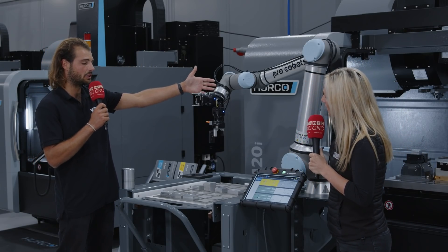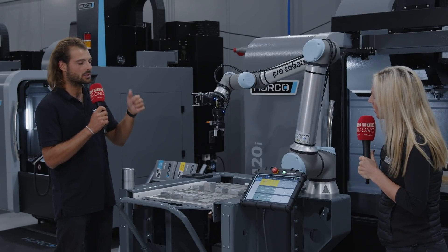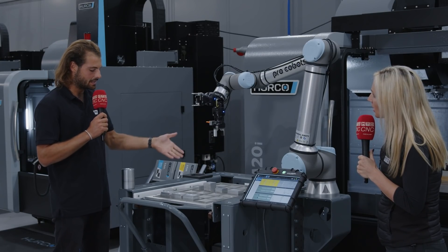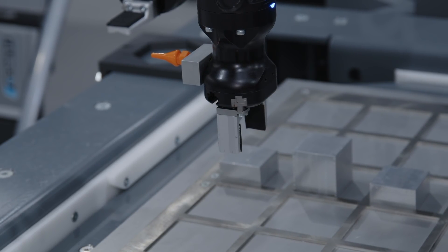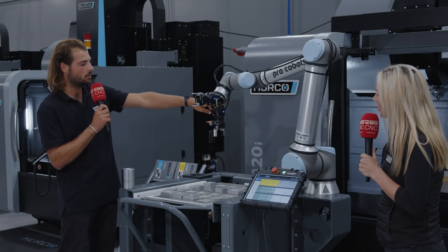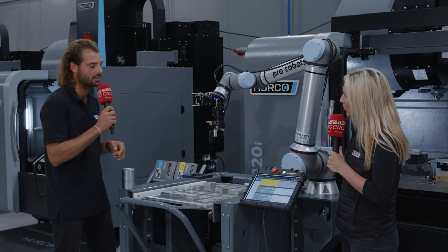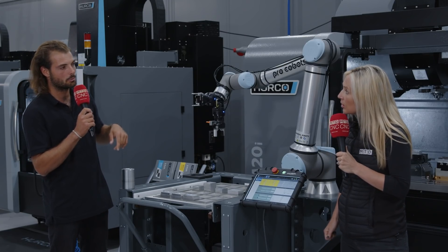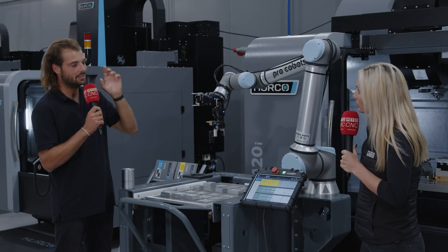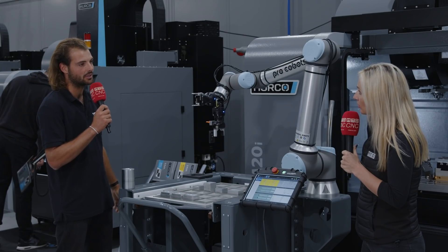When your robot brings the part over to the machine tool work bed, you need the workholding to automatically clamp and unclamp. So you can have hydraulic or pneumatic fixturing. For aluminium parts like these, pneumatic fixturing is acceptable because it offers slightly less clamping force than hydraulic. We have two pneumatic vices here with teeth on, just for clamping these aluminium parts. These are also controlled by the WinMax control software, so as long as you know your WinMax control software and have done that one day training, you can automate your process.